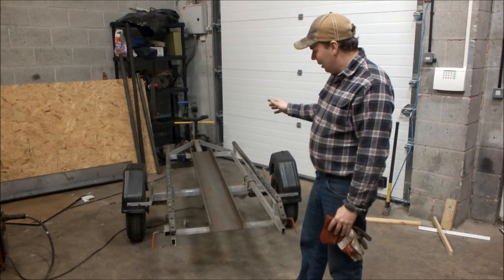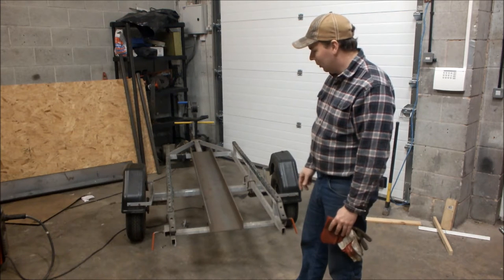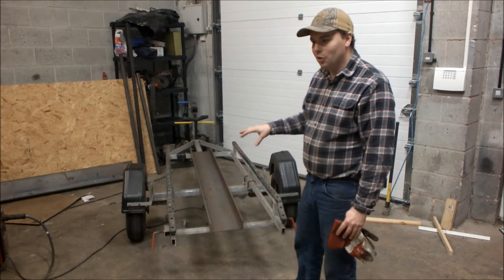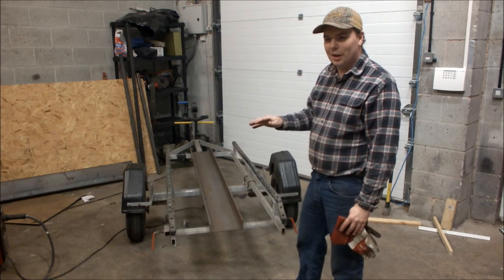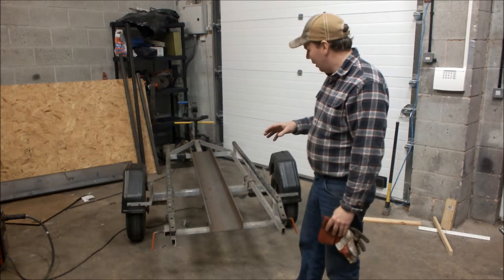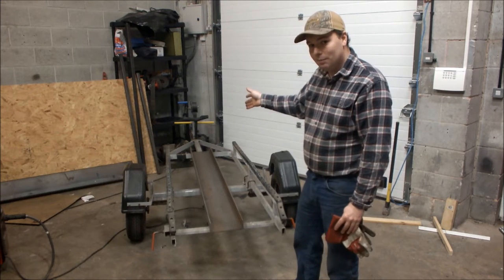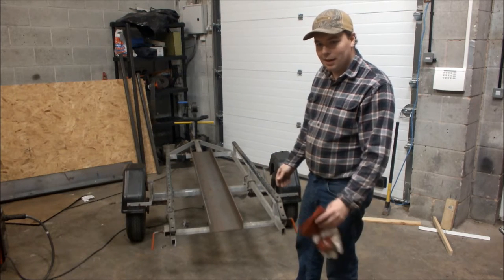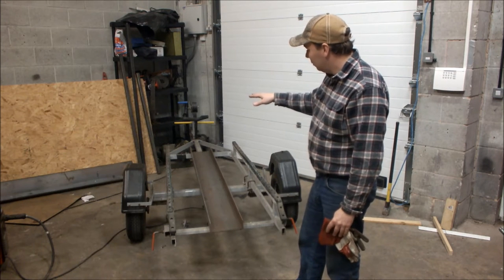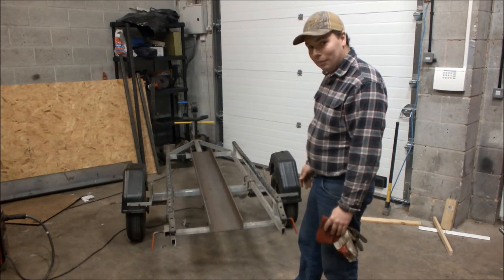The first job we're going to have to do is mark out where it needs to go - it's pretty central where it is now. Then, because this is a galvanised trailer, we've got to clean off all the galvanising, because you can't weld through it - it's terrible. I did a quick video before this one on how to weld to galvanised steel, really worth a watch. So we'll mark out where the welding is going to take place, clean it back with a linishing disc or wire brush in the angle grinder, clean up the mild steel quarter-inch plate, and then weld it down. Let's get on with it.